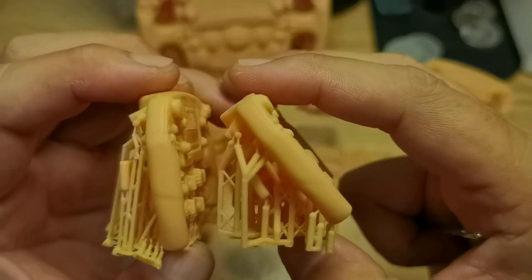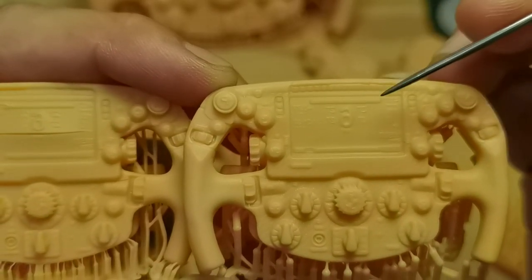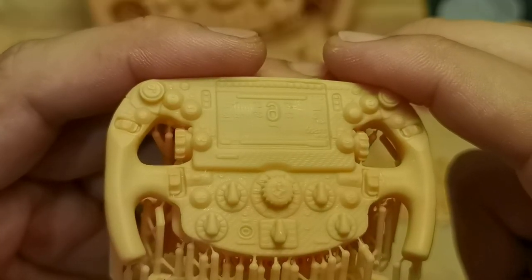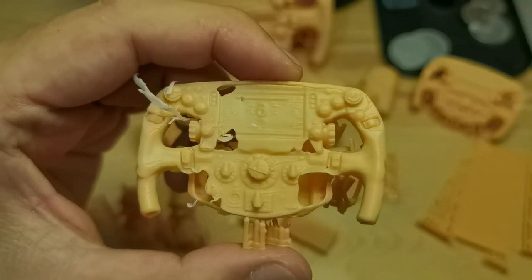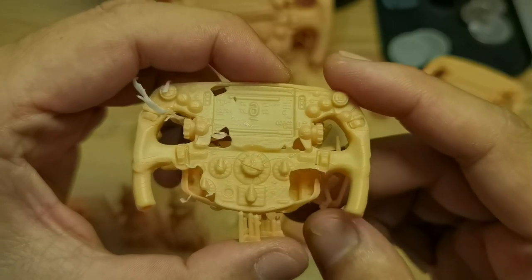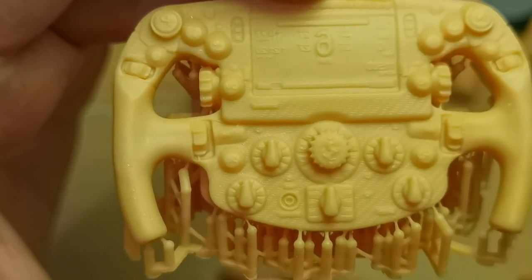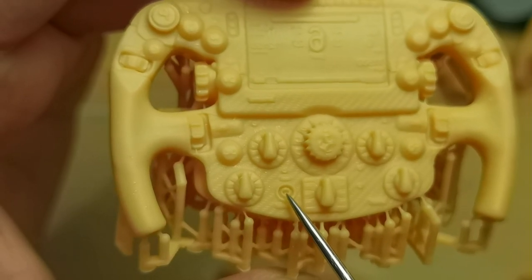So I tried giving the model more angle, and there was slight improvement — the numbers around the reverse 6 looked a bit sharper, but overall still looked overexposed. Then I tried printing at 30 microns, still using the big daddy 0.6 mm support tip. At high angle, 0.9 seconds failed; at 1 second, it succeeded. The result was much better compared to 50 microns but still looked somewhat overexposed.